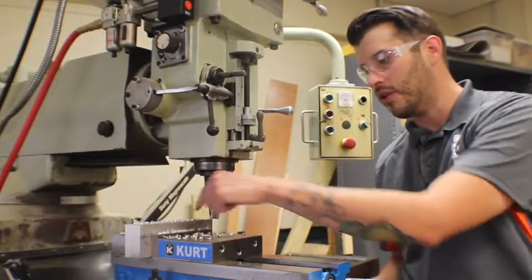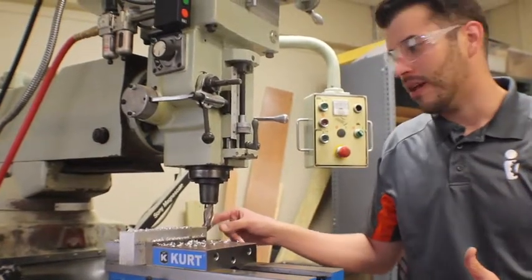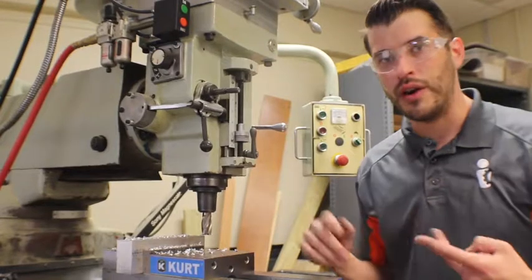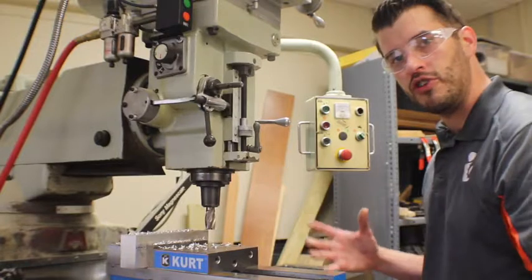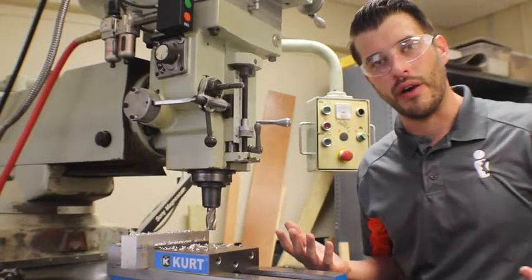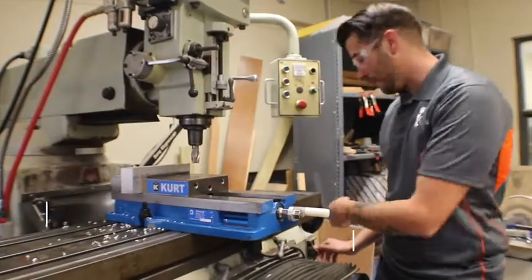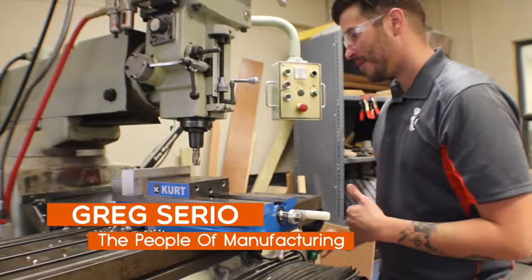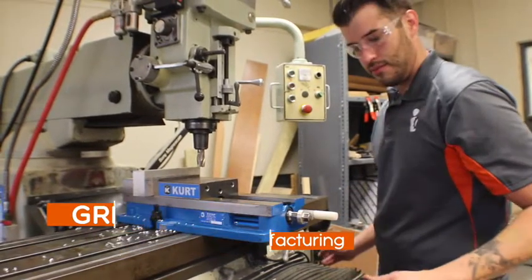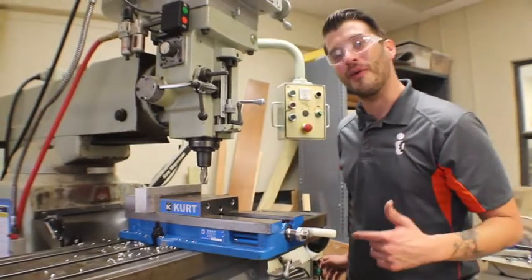You can tell we're almost done — we have one more pass to make to get across the whole length of the surface. I usually don't bury the full diameter because I don't have a lot of coolant, air nozzles, or bells and whistles that most machinists have on a manual machine, since we're just learning here. I'm going to blow these chips off and then make sure we're going the right direction because we're switching back.